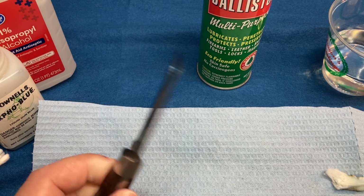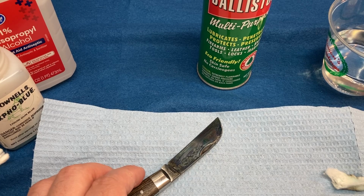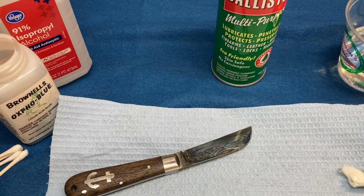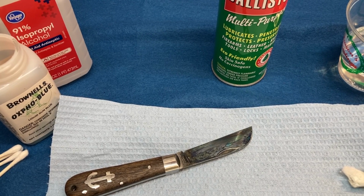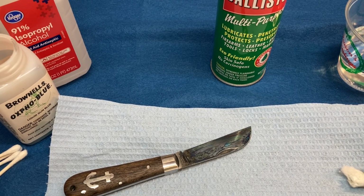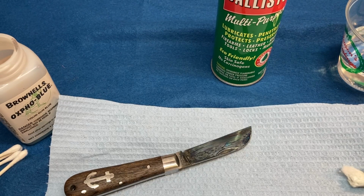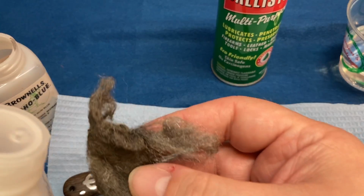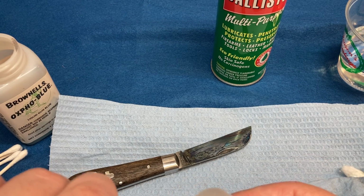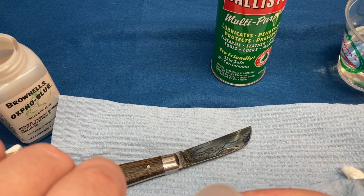So you need quad-aught steel wool, and this is called the carding process. It actually comes with oil in it, so you need to de-oil it. You can use brake cleaner for that. You can use alcohol for that. So here's your quad-aught steel wool. And let's see, get some rags here. I'm off frame, but basically you just kind of douse the steel wool with alcohol, and that's supposed to strip the oils out of it.